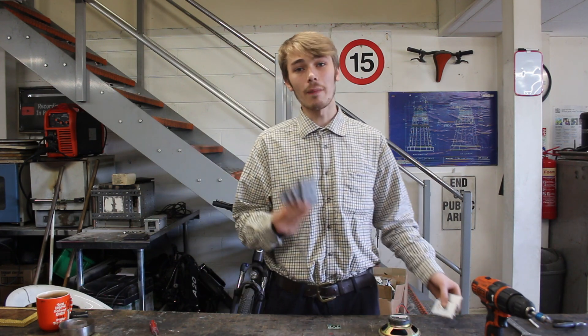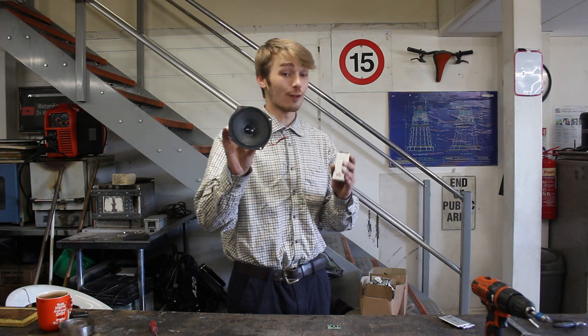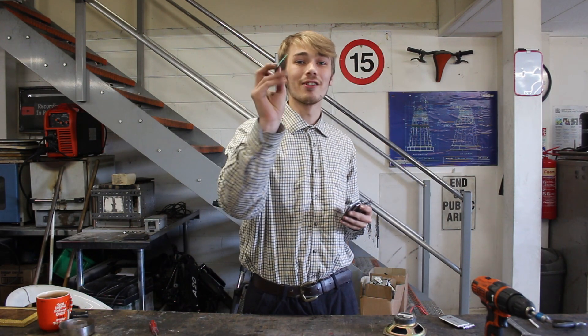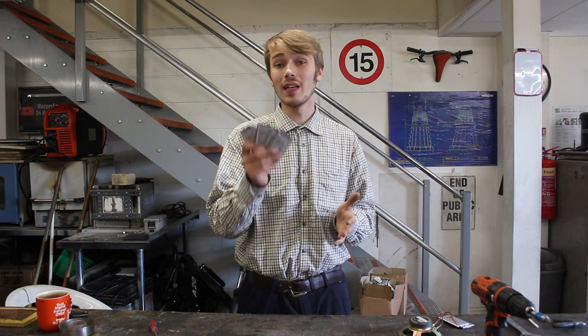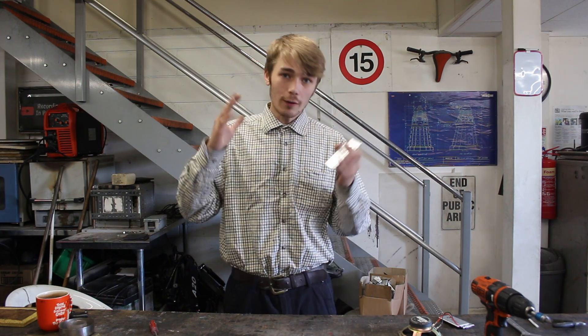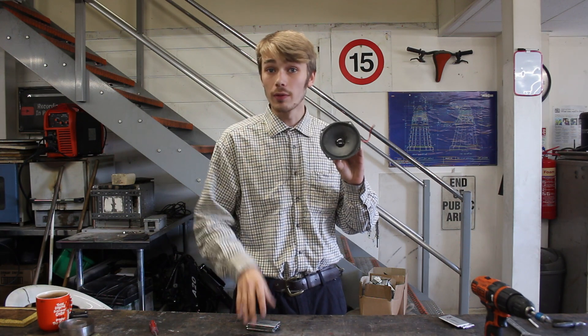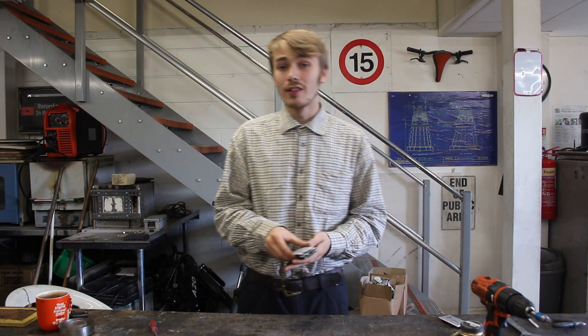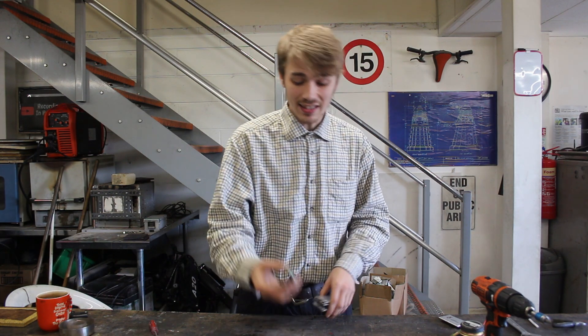The most important thing about a wireless speaker is the battery pack. I want to build a battery pack that will power this speaker for at least three to four hours using these phone batteries and this brand new BMS. I'll put the BMS information in the description. The pack is only going to be four batteries big — these are rated at 3,500 milliamp hours each at 3.85 volts. I've done the calculations and confirmed it can power the speaker for longer than two hours. We'll connect all four in series, giving us around 15 volts at about 3.5 amp hours. If you're interested in the wiring diagram, I'll put it up on screen now.